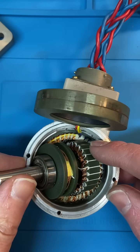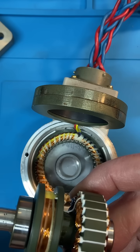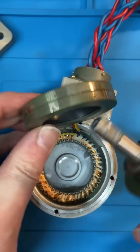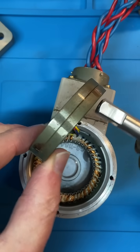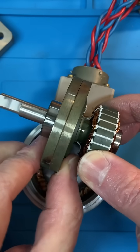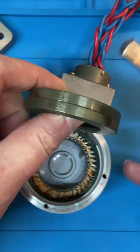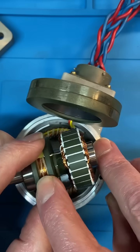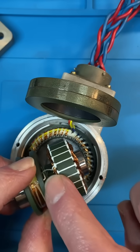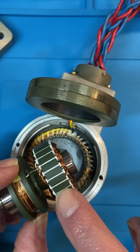Let's talk about how a brushless alternator works. The rotor looks like this — this is where the excitation comes in from the stator. The stator excitation winding looks like this, and the magnetic conduction is through these two rings, so it sits in there like that. In between the primary and the secondary you have a rectifier, so the current flowing through this rotor is DC.